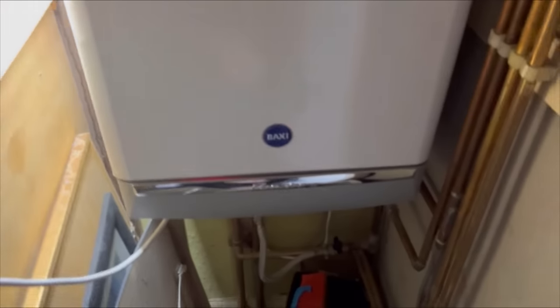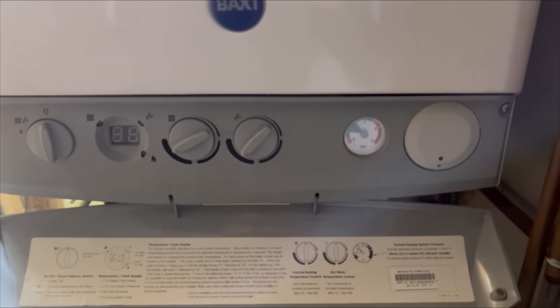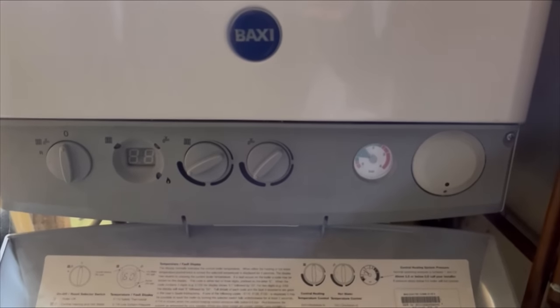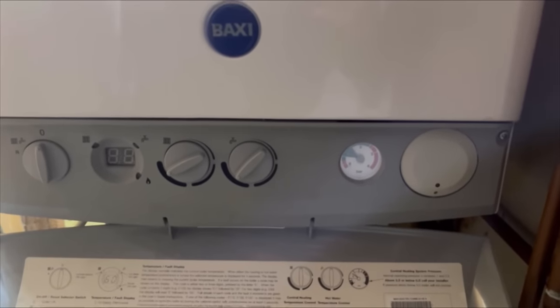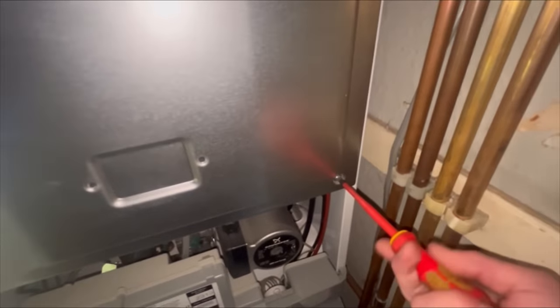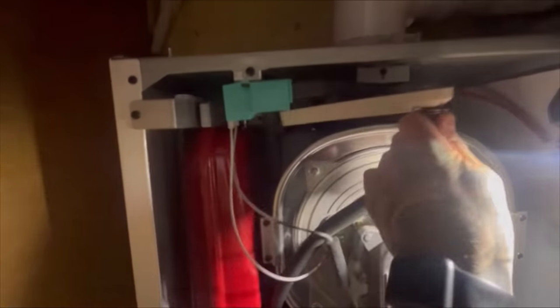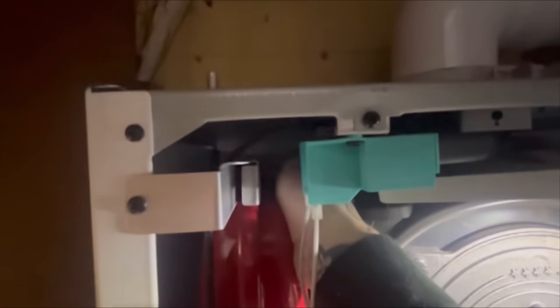Second one of the day, second back to Duotech, can get knocked off. Basically when the heating's on, the pressure's rising right over to 3. And then when it cools down again, the heating's off, there's not enough water pressure. And it's going to an E119 fault. Says to me the expansion vessel's flat. 2015 boiler, but it's never been serviced. So lift the cover off and see what the pressure is inside the expansion vessel. That'll give us access to the Schrader valve core.